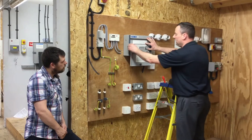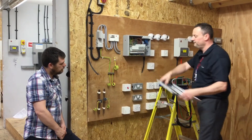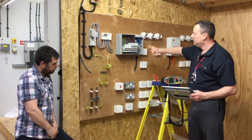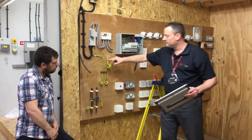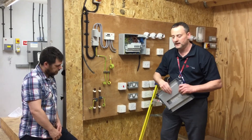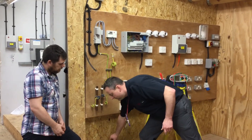The installation is now isolated. The consumer unit cover needs to be removed so we can access the incoming line conductor, which is still live, and we're going to disconnect our earthing conductor — the conductors under test for our external earth fault loop impedance.